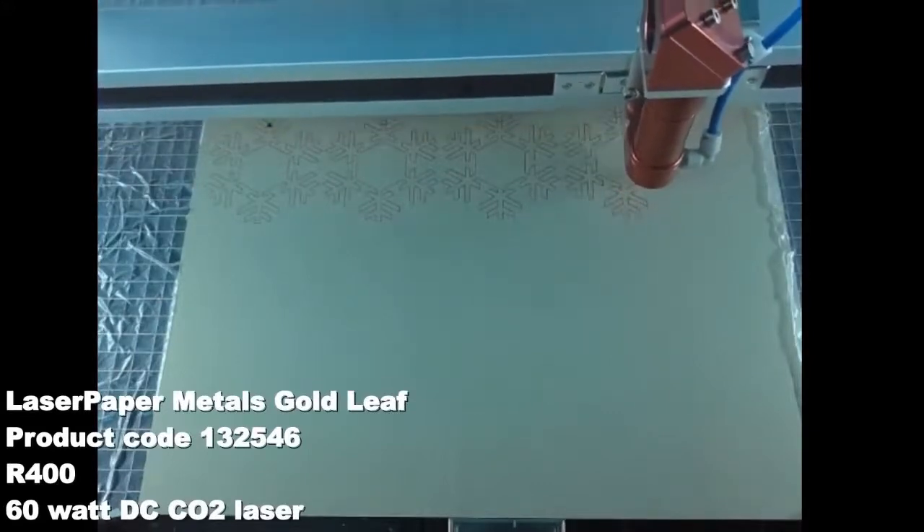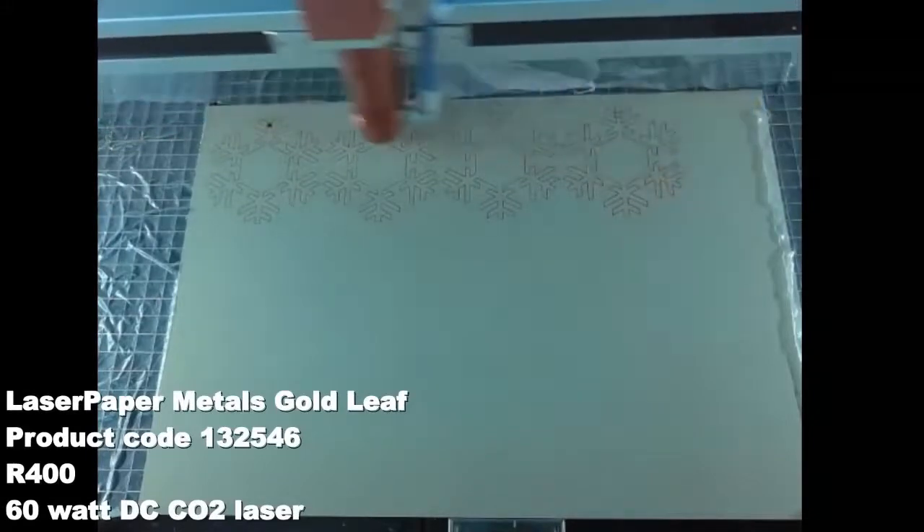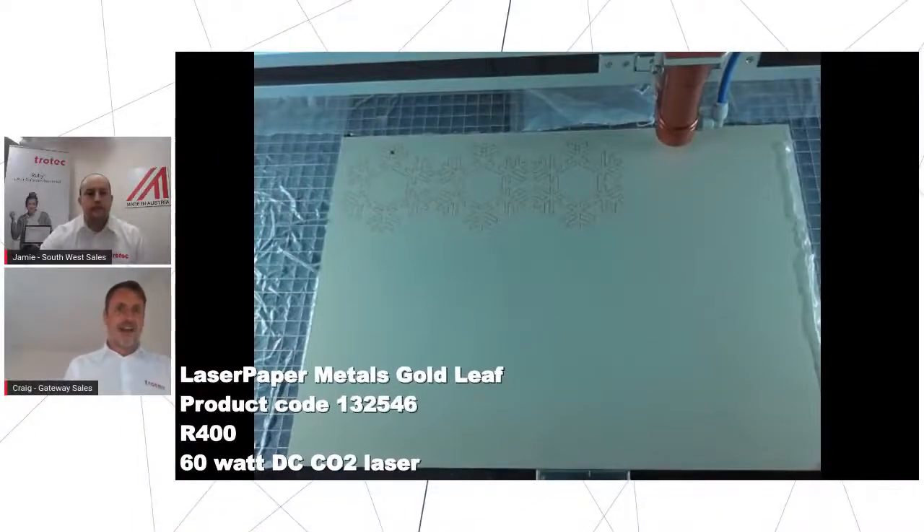This is a 60-watt machine, also available in 100 watt. Just a little tip: you can see the blue tube on the right-hand side of the laser head — that's the air assist, and we've had that turned right down for this. We also recommend having the bed clean. I didn't do that the first time and had some wood residue on the back, so I'd recommend just having a clean bed. With all glass tube machines there's a little bit of extra kit required — we provide the chiller, the compressor for the air assist, and the standard active air exhaust as part of the package.